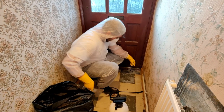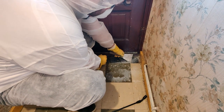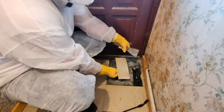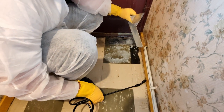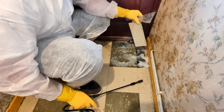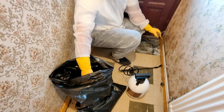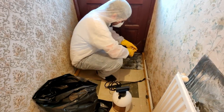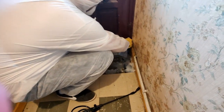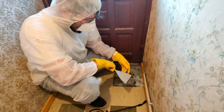I'm just going to try this one now so you can see how easily these ones are coming up. This one's at quite a difficult angle. You can see that one came straight up, and this mastic here is likely to have asbestos in it as well. So that goes into a double-lined rubble sack, wet inside there as well, and that will go to hazardous waste. It's just a case of working through one by one.